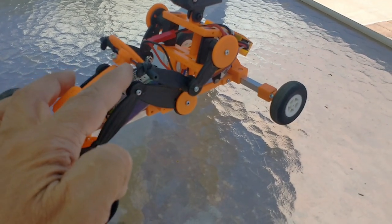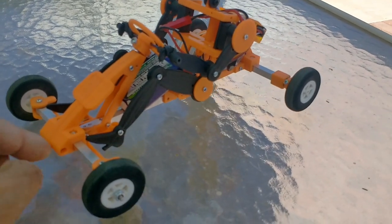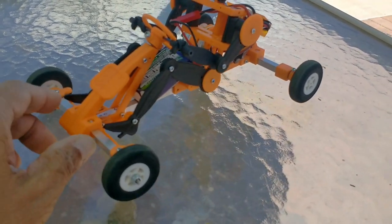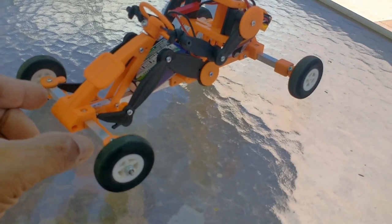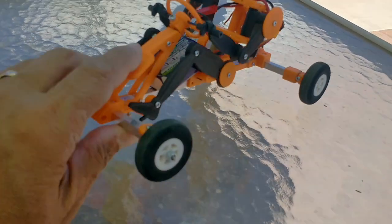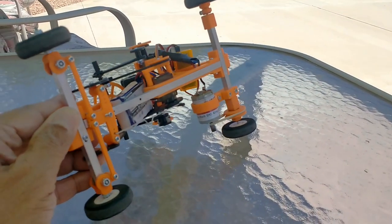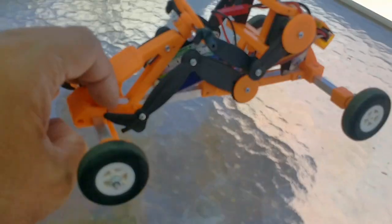For the steering, because of these angles here, I had this link to the hands just like you see it here, but these were operated by two servos in differential mode. They had to steer the wheel, and the wheel had a shaft, and that shaft had an angle to the steering column, or to the steering rods, and the rods had to be at the front. I really didn't like that setup with the rods at the front. So I wanted the rods at the back, as you see it here. The rods are underneath, and there's this linkage direct to the one servo.